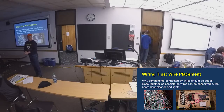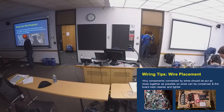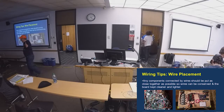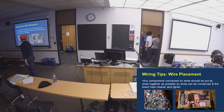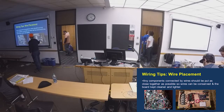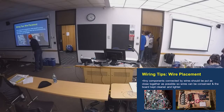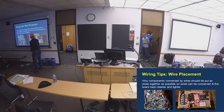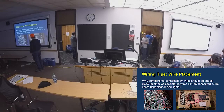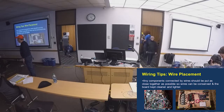What our team has done for the past several years is make removable boards. What's not nice is coming up to a robot with wires going everywhere and the electrical person doesn't know where anything goes. This was our 2015 board — a simple layout with the D-Link, all our Talon SRs, everything close to the power distribution, cables routed neatly together, a latch for our battery connection, and every wire has a label on it.